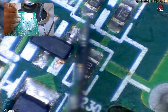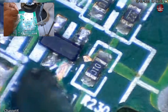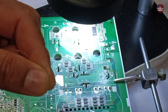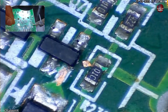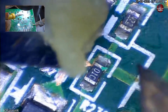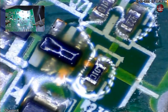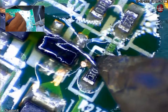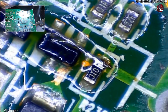Now I will prepare this other broken trace to be fixed. I will clean the solder mask from this side. I think if I directly solder the wire here, it will be easier. The wire I am using to fix the traces is not easily visible — they are very thin, but visible in the microscopic camera. Now I will solder these wires. I will put some flux before soldering and then solder the wire to the resistor.